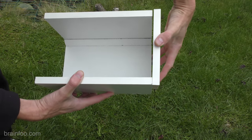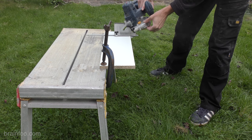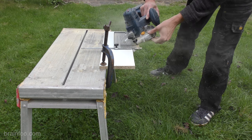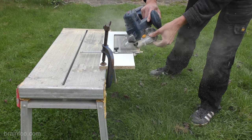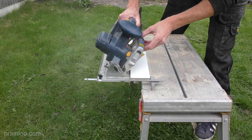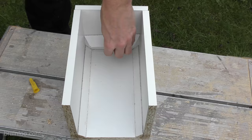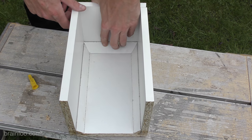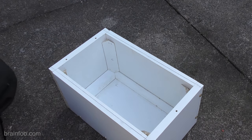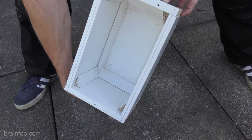The two end caps are next, and when they're cut they'll fit onto the end like this. The last fillet strips to cut and shape are the ends of the hammer, and for that we need to cut a 60-degree angle — so ignoring health and safety I took my circular saw off its stops and forced a 60-degree cut. This really is the only tricky cut to make, and as I have no table saw I just had to do it this way. With that done I can run down the other side at a much more sensible 30-degree angle, leaving us with these sharp-looking right angles. Once cut, they fit in and are siliconed to the base only, not the sides. More 60-degree fillets can then be cut and siliconed to the sides, not the ends.